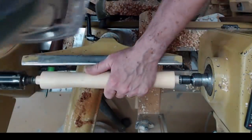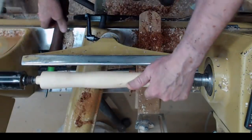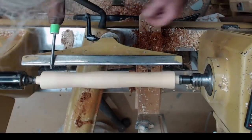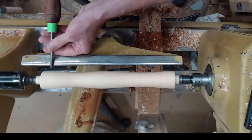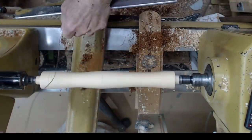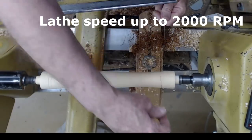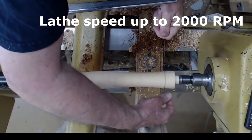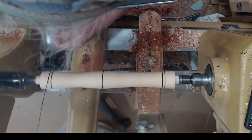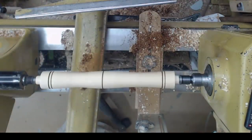We're going to add some embellishing to that center post. It's certainly overkill — it's not necessary, and it'll be covered up by paper most of the time. But when you're changing the roll, it'll look nice. I'm going to put some burn rings, so I'll get the speed up to a couple thousand RPM. Dropping that wrist in the back is what gives it the friction — and there we go. I think that adds a nice little touch.